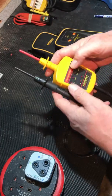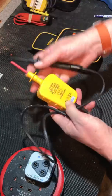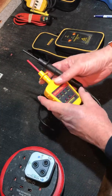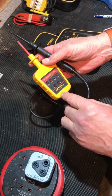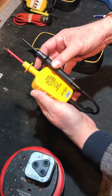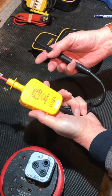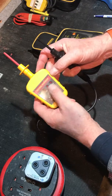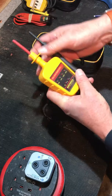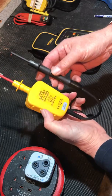These don't look as though the probe tips are replaceable, which is a shame - they always get twisted and battered. This is a 2014 model, still current. They make the VI 5000 now which I think goes up to 1000 volts, but I haven't picked one of those up yet - that's on my shopping list. You can only see voltage in one direction, but there are clear LED indications from 50 volts to 400. Maximum voltage on this is 50 volts to 600 volts AC and DC. There are no batteries.